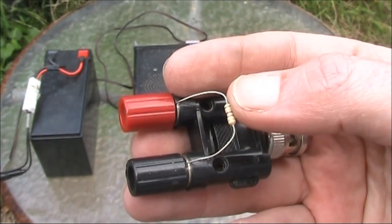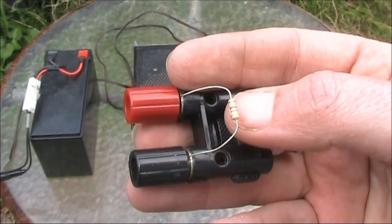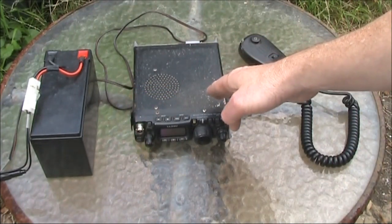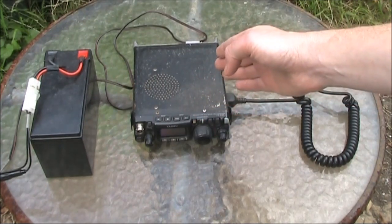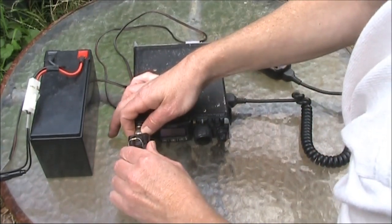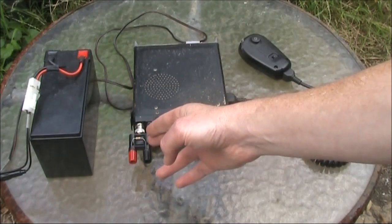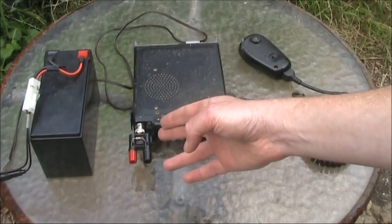This is only a small resistor rated at a quarter watt. If you've got a 1 or 2 watt resistor and you want to get an indication of higher levels of power, then that might be more suitable. I've set the FT817 up for FM, but you can use a constant carrier mode like CW. I'll now just plug in our dummy load. This is basically what it is — it's a 50 ohm dummy load. If your resistor is a little bit different in value, like maybe 39 ohm or 68, then it should still be roughly okay. After all, this is only very, very approximate.